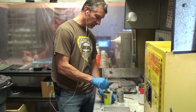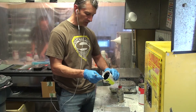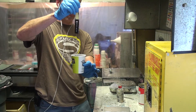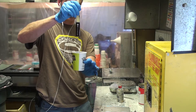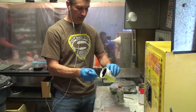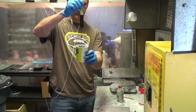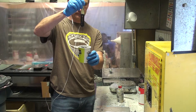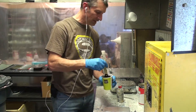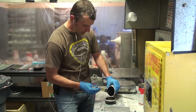There's a slot and a series of holes on the spatula. Once we've mixed our ink, we cover the hole up, and when that hole pops we count the seconds it takes to travel from the top to the bottom of the spatula. If we count seven seconds, we know we're in the general ballpark. In this case it might be a little fast, but it's just fine. Then we'll pour our ink mix into the cup.